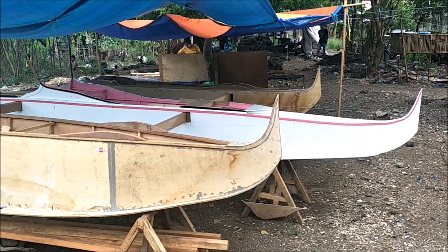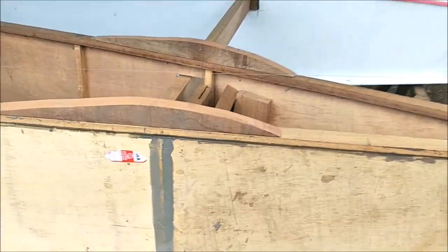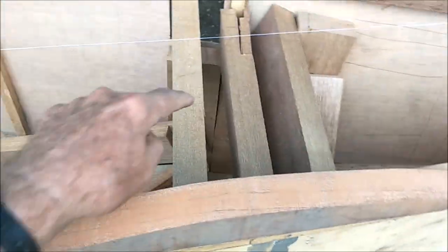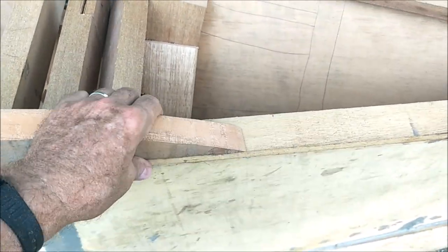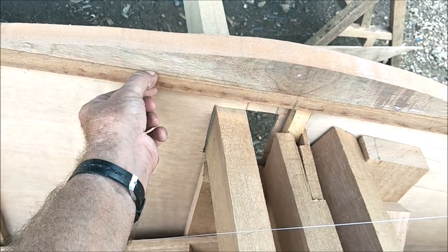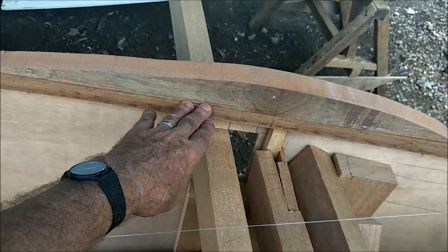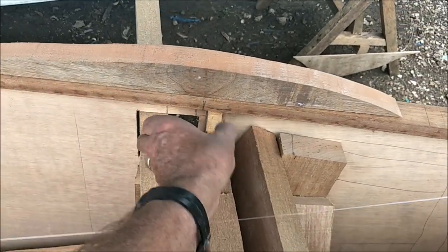Everybody. What we have been doing all day today is cutting these things out. These little guys here. And what these are for is this is where the cross brace is here, and this is to kind of beef up the top because there's not much here. There's like a 1x2 here, and we've added stuff here to distribute the load as this thing tries to twist. We don't want it to just twist right here.